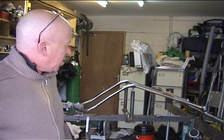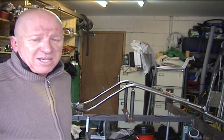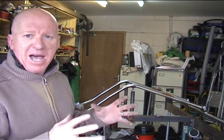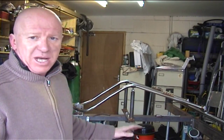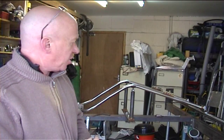And that's the side rails done. It's got the backrest plates on there. It's got plates on the front and the back for the axle and the swan neck. So all that's left to do now is let that cool down in the jig — everything's being held so it can't go anywhere. Wait until it cools down, release all the bolts, and buff it up, get it all nice and shiny again.